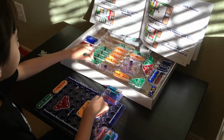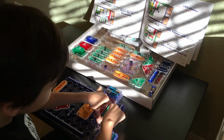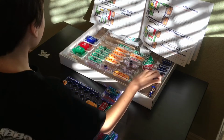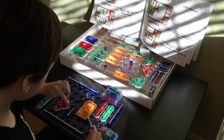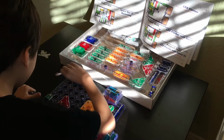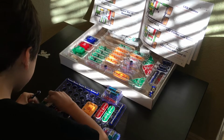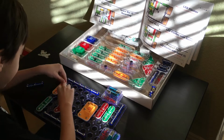Alright. And then we're going to have the same thing for the D2 right next to it. Orientation is important, same on the D2. Alright, and then we're going to have a 3 that's going to go over at F7. A, B, C, D, F. Okay, A, wait. Everything is covering it up in here. A, B, C, D. Okay, there we go. I'm going to put this resistor back on over here, the correct orientation.